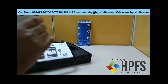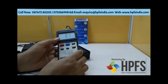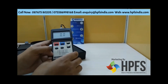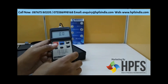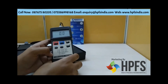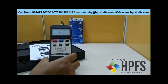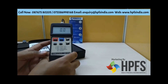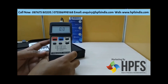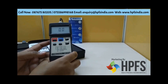Coming to the specifications: the velocity range is 200 mm per second and the acceleration range is 200 meters per second squared. The frequency range is approximately 10 Hz to 1 kHz under normal conditions. The accuracy is plus or minus 5 percent of reading, measured at 160 Hz and 23 degrees Celsius plus or minus 5 degrees.